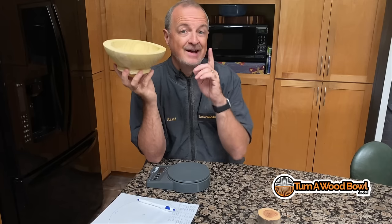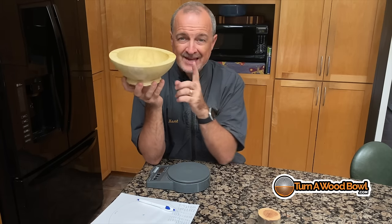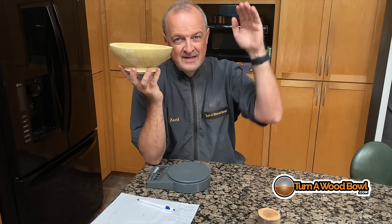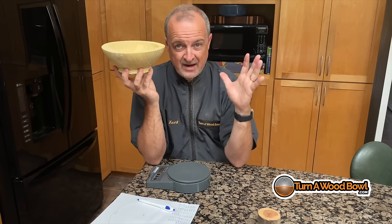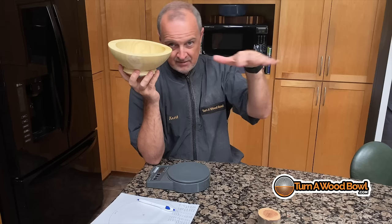If you put the bowl in a heat-oriented dryer — such as one with a light bulb or other heat source — it is possible to suck more moisture out than is in the surrounding air. I've done that before. I had a bowl in a really hot dryer for a long time, and as I was weighing it days later in a house environment, the bowl was actually gaining weight. The fibers of the wood had dried out below the average humidity in the room, and it was actually sucking up moisture from the air and storing it in the cells. There's no such thing as dry — you're basically going to equalize the moisture in the wood to the ambient humidity in your particular environment.